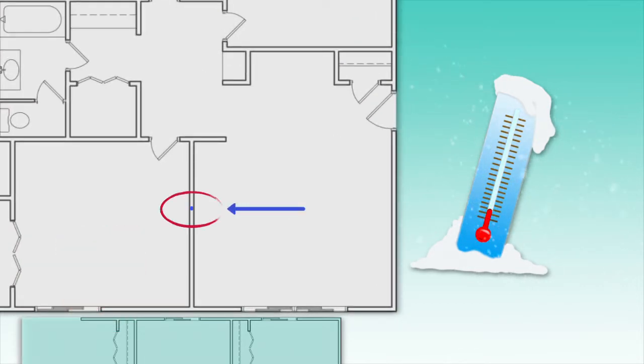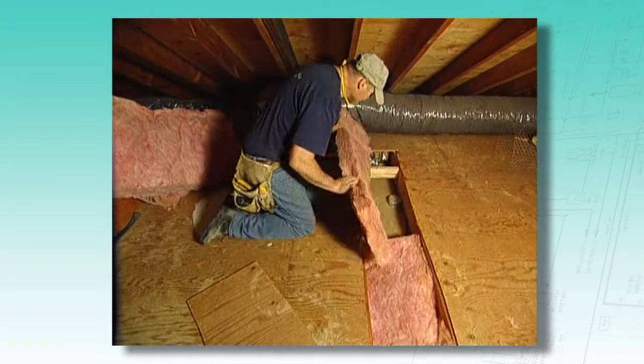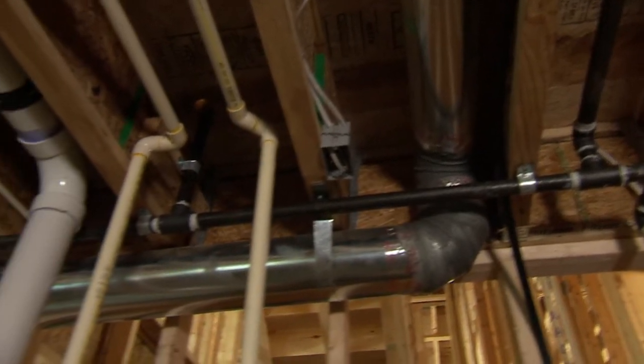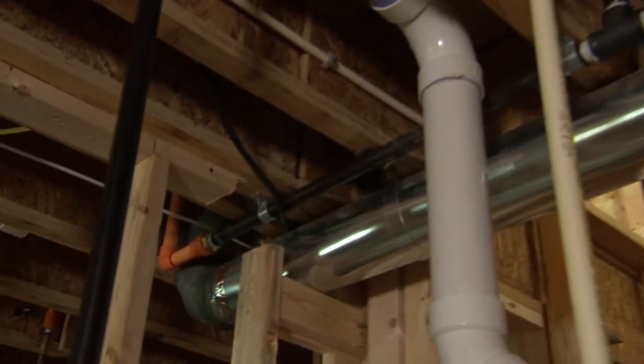This may include installing sprinkler piping in interior walls, avoiding placement of pipes in unheated attics, or in the alternative, using insulation or installing dry pipe systems which keep all water out of sprinkler pipes until a sprinkler activates.